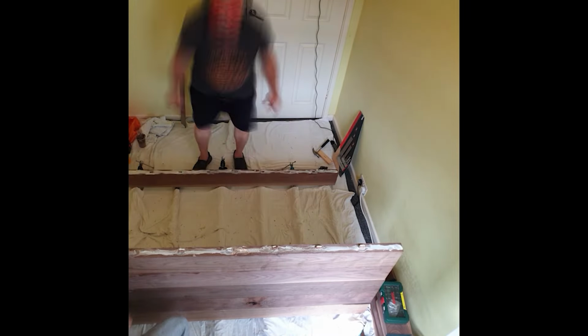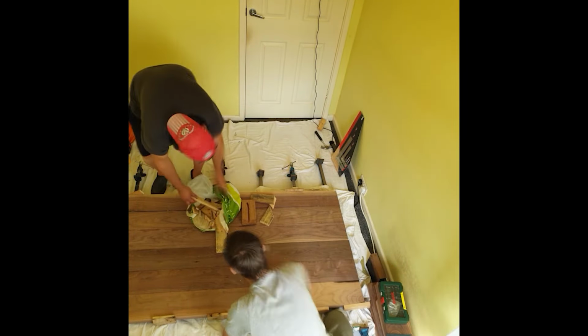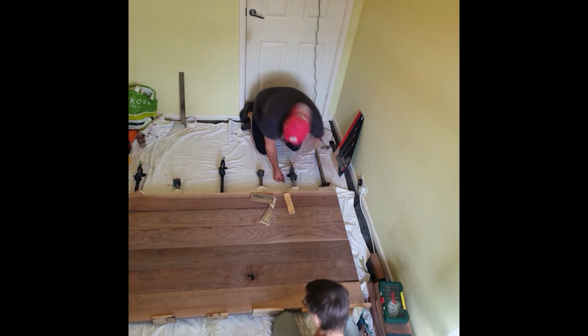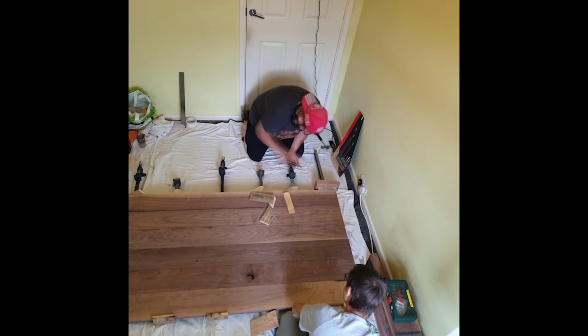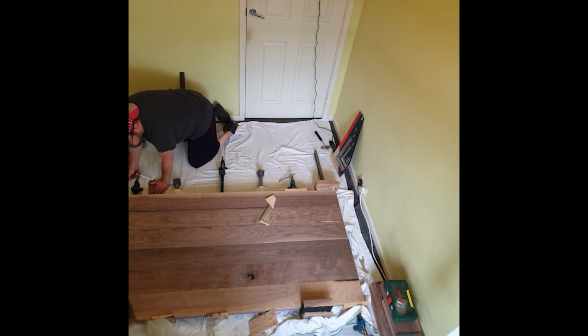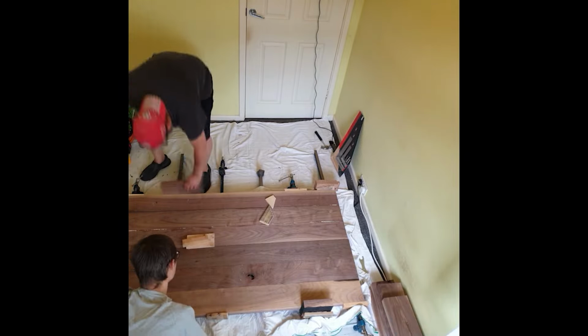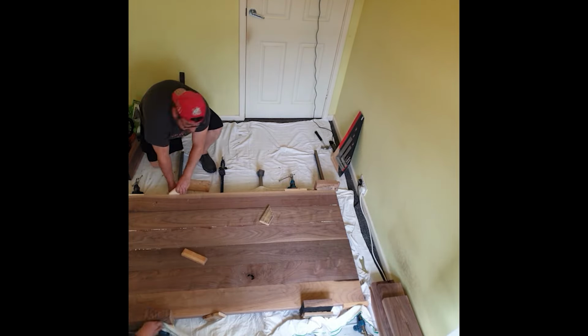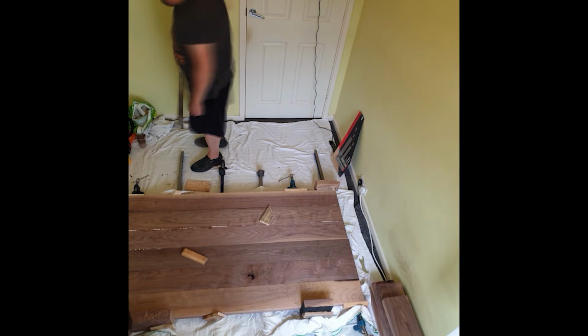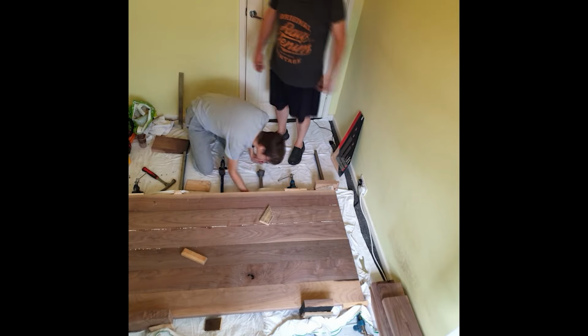Now after you tidy up the clamps, what I did in here, for example, every 10 or 15 minutes I came and kept on spinning the clamps and tightening the table even harder, but at the same time making sure that the in betweens are not going to bend the shape of the table. So every time you work with wood and you use epoxy or glue, attend to it every so often, because you never know how the force that will be applied to it will influence the table.